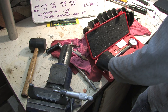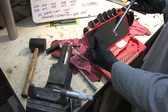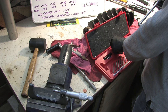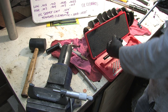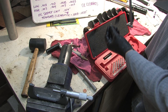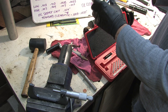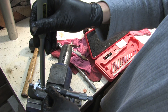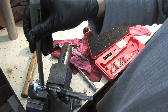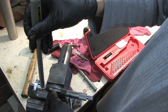So now I finally get a chance to play with the cool tools. I've got to get this thing set up to measure the mains. We already measured the journals at 2.2431 or 2.2430 depending on which journal you're looking at, so I'm going to set the tool up for 2.250. I'll do that by putting the .05 ring on the 2.2 probe and attaching the collar. You press the plunger against the anvil and line up the bottom half so that you're making contact on both ends of the bore gauge.